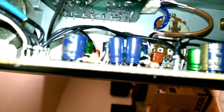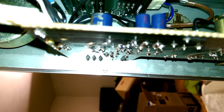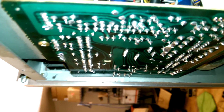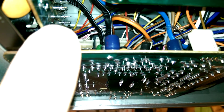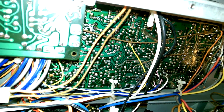All new caps on the tone control board. You'll see those green ones are Nichikon Muse; I've snuck in some film caps, and the rest are Panasonic FC. There are a couple of Nichikon KLs where film was just going to be too big. Replacing the existing low-leakage electrolytic — non-polarized were of course replaced with Nichikon ES. A few new caps on the microphone preamp and signal selection board, and of course all the cold solder joints were touched up.